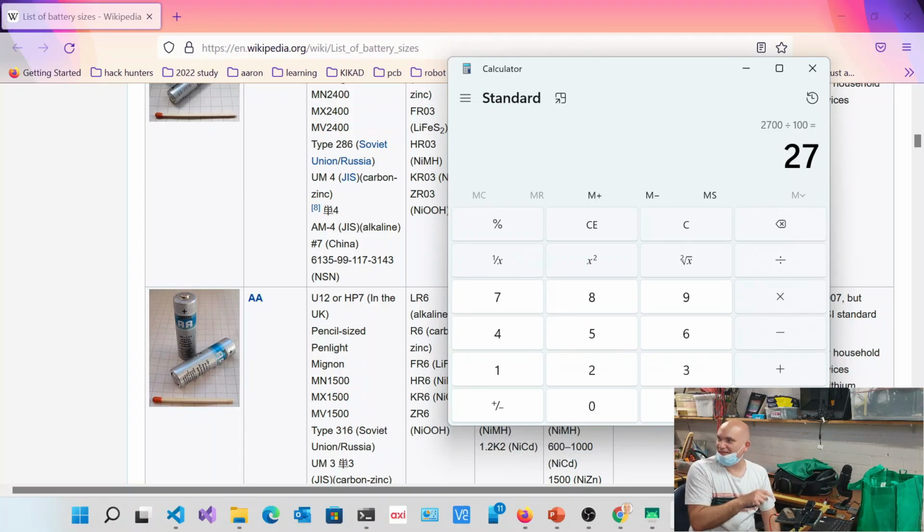That's if I ran this program on one of those batteries, and that's not really the whole story, because the truth of the matter is that that's a 1.5 volt battery. Remember that I said that if I wanted to boost it up to 3.3 volts, I'd have to sacrifice more of that capacity. There are calculators out there that will help you calculate what that cost is. Generally, what you would do is have 2 or 3 batteries, and then instead of boosting it up, you would buck it down.